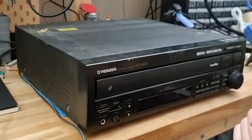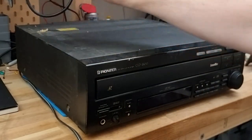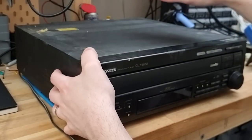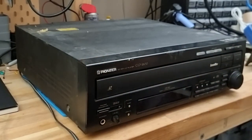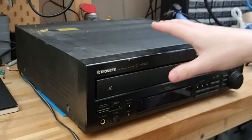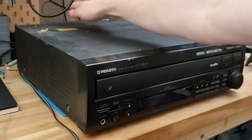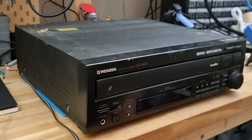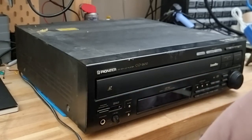So that's awesome. Okay. LaserDisc, so you can see on top it's a little bit dirtier, the labels are falling apart. This is also the big double unit, so by that I mean with the LaserDisc you would normally have to play side one, eject, swap over, put side two in. This has the extra box at the back, I believe, where it's a double side unit where the actual sled that the laser assembly is on goes all the way back and then rotates and then comes back to play the other side without having to get up from the couch and change it over. So it'd be kind of cool if this works, or if we can get it working even.